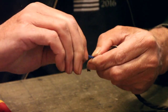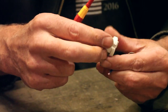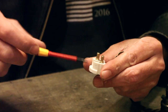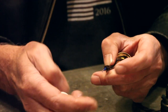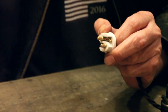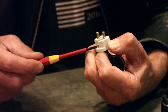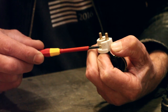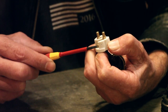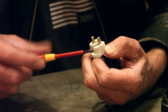With the braided cable still together, we're going to wire the ceramic connector. Again we start with stripping the cable — bend and turn. Here's the ceramic connector. We need to open these terminals up so there's somewhere for the cable to go, and this will go into the back. You can also see in the front that the cable is just coming out of the top of the connector, so that when you tighten the screw from behind it will grip the cable.